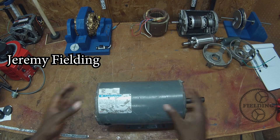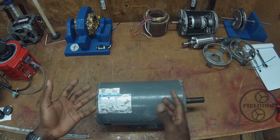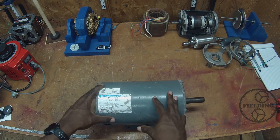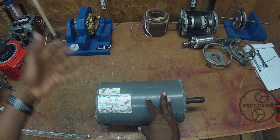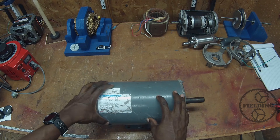The three-phase motor is by far the most widely used in industrial applications, especially where you need good, consistent speed even under varying loads. The induction motor is very rugged — it's only got a few parts, as I'm going to show you here in a moment. And it's actually simpler than the single-phase induction motor, and that's why I want to show you this one first. Let's begin by breaking this guy open, and then we'll talk about the components that are there.